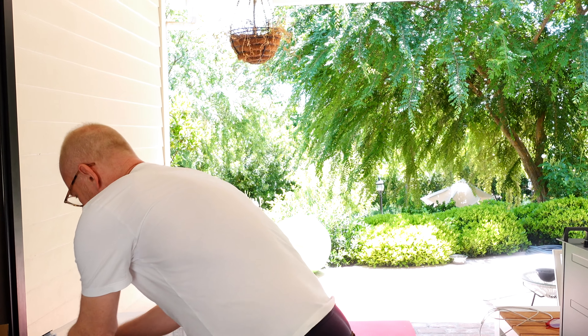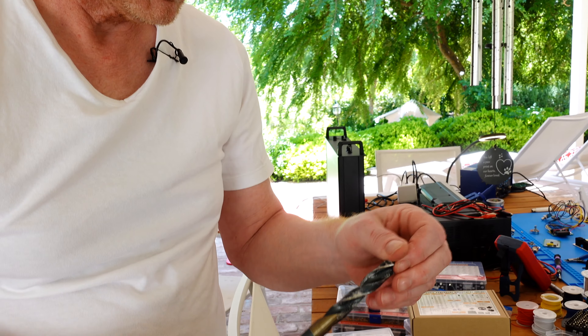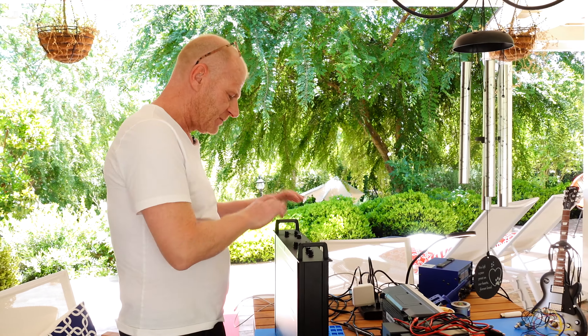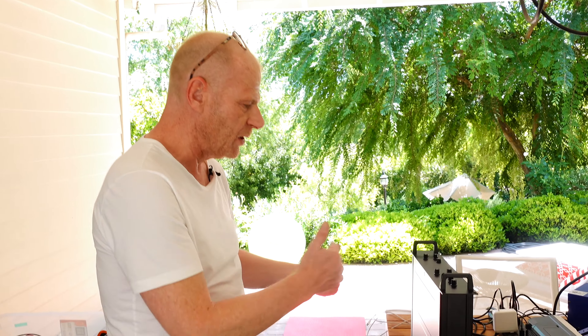Then with a power drill and a unique step-drill set — because for electronics you sometimes need really large holes, sometimes thicker than my thumb — you drill them out. These bits die relatively quickly when making holes that large, so I went through a few. The little reverb unit I just showed you is one of eight modules I've built that are going to go into this rack. Today's plan is to finish designing the front panel, mark it all out, start drilling holes, and begin assembling everything into the box. I'll see you soon.